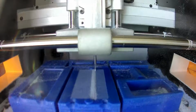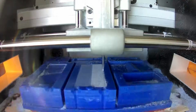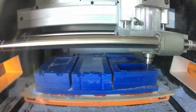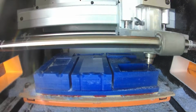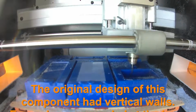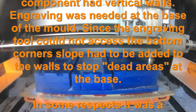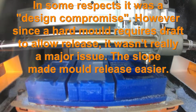In the next section, I'm going to use an even finer engraving tool to go deep in another part of the mould, which is the matching portion of that serration. I didn't just use the one tool all the way, because as the tool gets finer and finer, you have to machine more and more slowly, so it gets very time consuming to use very fine tools on these moulds. So, the total time for one of these machining is about an hour and a half.